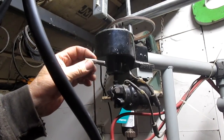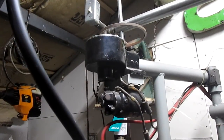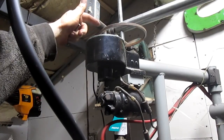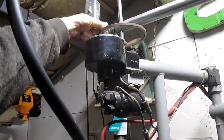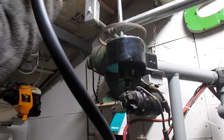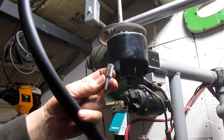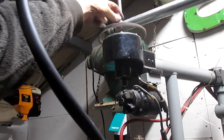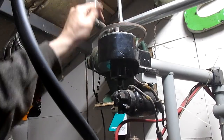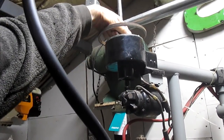All right, well, so for cutting the straight lines in the plate, I used the 1/4 inch follower, and now can you see it up there? Yeah, a little bit. Now we've got a ring up here, and it was a certain size, and it's a little bit too big. So what I've done is I brought in a 1/2 inch follower, and that's going to give us a little bit smaller circle. But hopefully it will work, but we don't know yet.